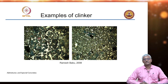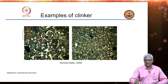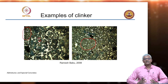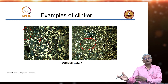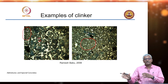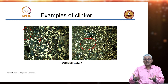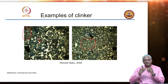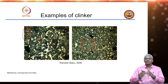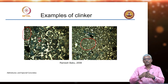Another example of clinker seen under the optical microscope shows C3S particles and a cluster of C2S — here you see a large cluster of C2S with some C3S in the system. All of these cements end up being ordinary Portland cement. In India, we have graded cement — 53, 43, and so on — they are all ultimately ordinary Portland cement, but their internal structure could differ significantly. All of these characteristics of the way the clinker has formed inside the kiln can have a bearing on the actual reactivity and performance of these cements. It is fairly complex to truly predict cement performance just based on its structure or its composition — you need both angles to be looked at carefully.